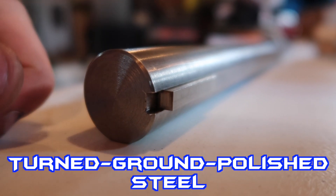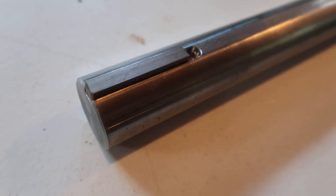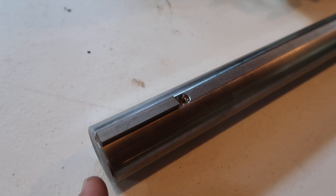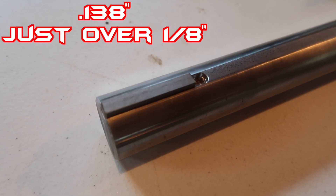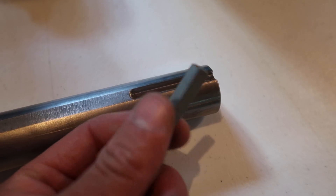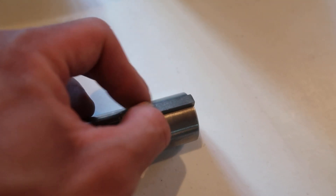Because it was TGP, I did not need to do anything to the outside diameter of the material. When I put it up in the mill, I found my zero and then I programmed a quarter-inch wide keyway, which is two inches long from the face to the center of the radius. The keyway is 138 thousandths deep from the top of the radius of the TGP. The keys are just quarter-inch stainless steel keystock — they drop right in and slide.